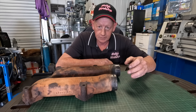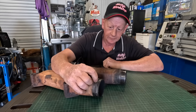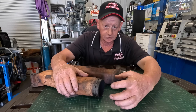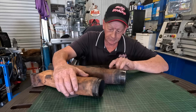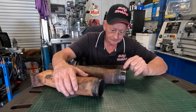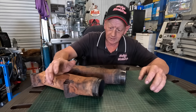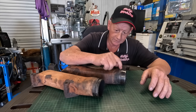When they pulled the motor out, they pulled the manifolds off. There's a groove in here which is what they call a firing ring groove, and when the next section goes on, that's what seals the manifold. This one has been welded up at some stage, and they had a heap of exhaust tape around it to stop it blowing soot everywhere. What I've been asked to do is try and machine the groove back in this one.